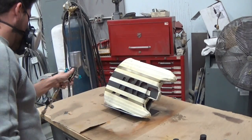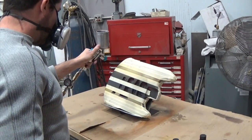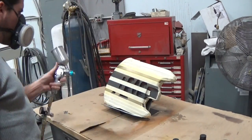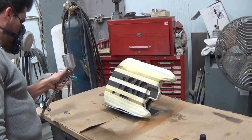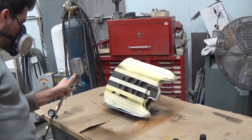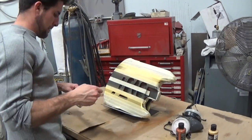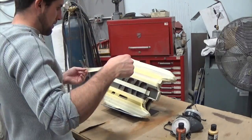Because I'm using this automotive acrylic, I'm just kind of lightly dusting it on — that's basically how you spray these. You don't need the flow that you would get with a polyurethane or even a lacquer. This stuff goes on real light, that's part of what makes it so easy to spray. I did about three coats of that, and now I'm gonna cover it up.